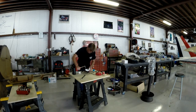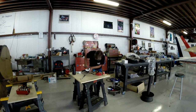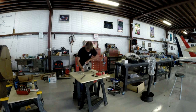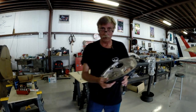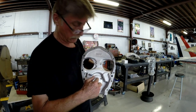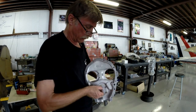These attachment hardware pieces are also required to be safety wired — they're castellated nuts. That's why you have a 20-pound torque range: it's important to line the castellations in the nut up with the holes in the studs so you can insert safety wire. We're going to safety wire these two together and these two together. It would be silly to safety wire across the oil pump area — that's your crankshaft gear engaging the camshaft, and that has to spin freely because it drives your oil pump.